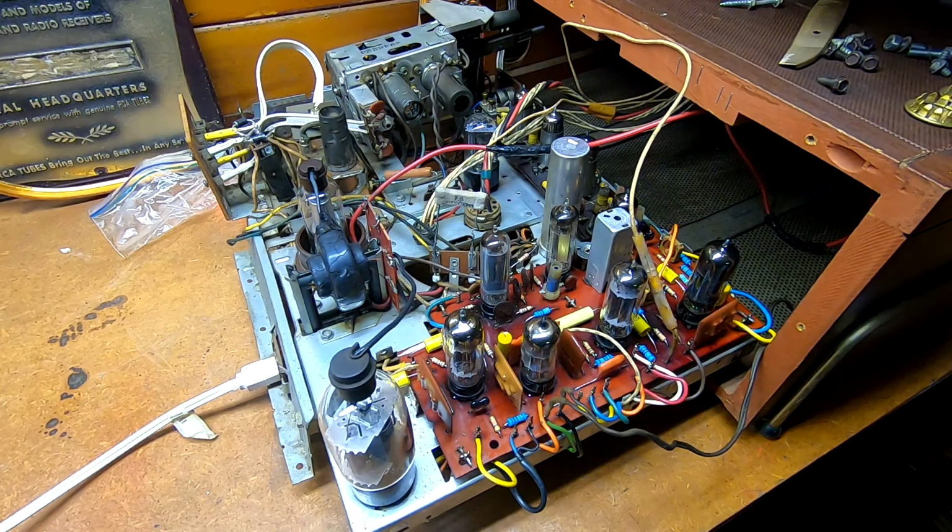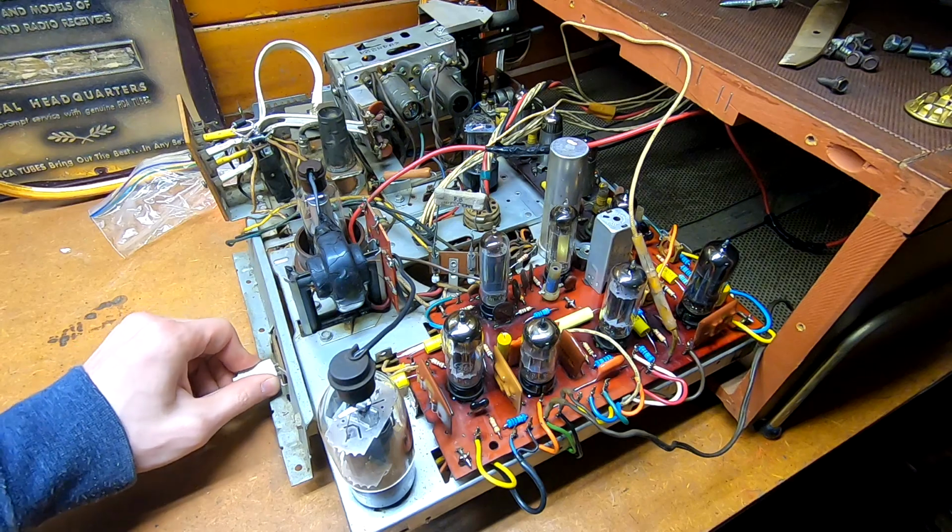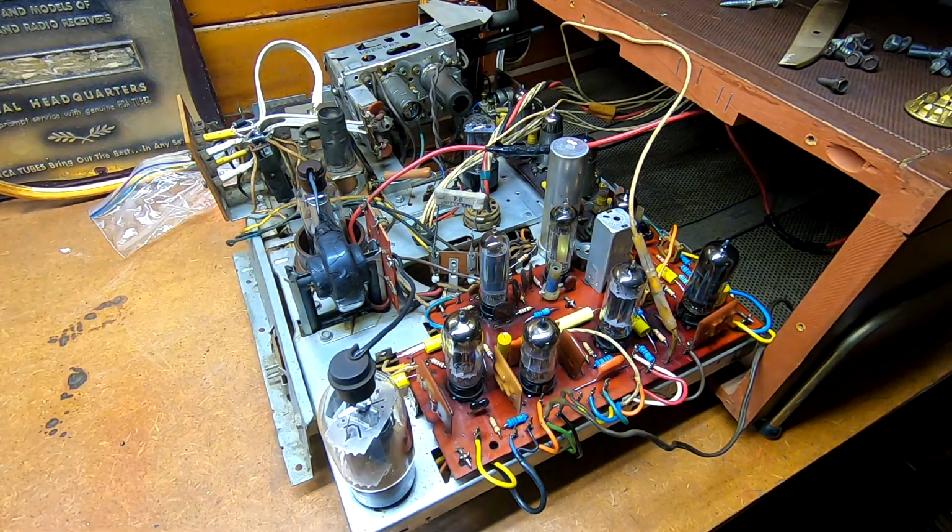But I can imagine there's probably some components over in the flyback circuit that aren't super up to snuff anymore. It obviously does not sound very happy. Frankly, I've never heard of a flyback transformer make that kind of noise before, and if you saw from the way that the picture was flickering to the tune of that thing, something is either, I don't know, arcing or leaking intermittently like that. Pretty good.